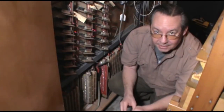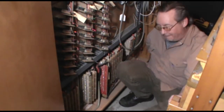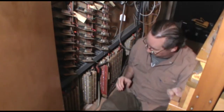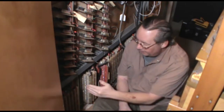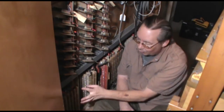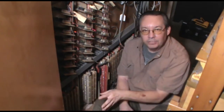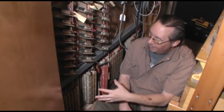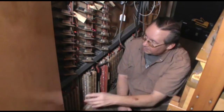This is a very cramped space and the lighting is really not great, but let's see if I can get in here and show you this. We have our Peterson relay. The way it works is the key signal comes into the front end of a card, and all of these are basically stop switches that route the keying information out to the appropriate pipes. Since this is a unit organ, we're going to have several stops — the principal will be at 8, 4, and 2, the flute at 8, 4, and 2, and so forth. All that is summed up.